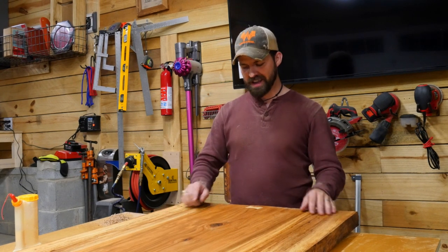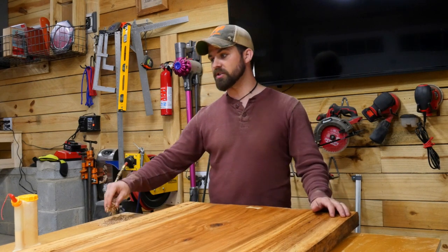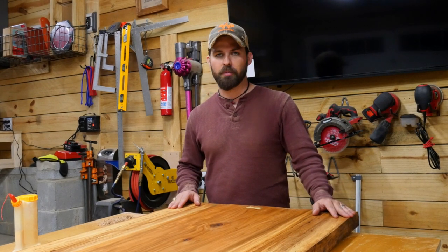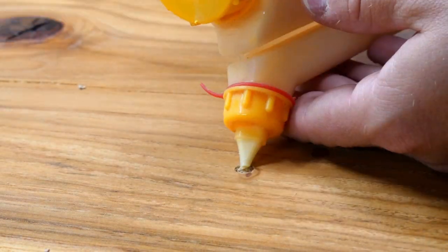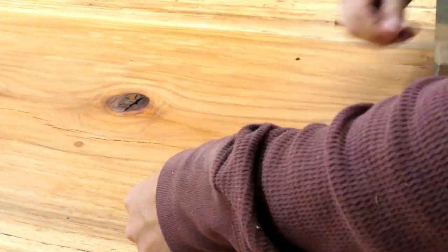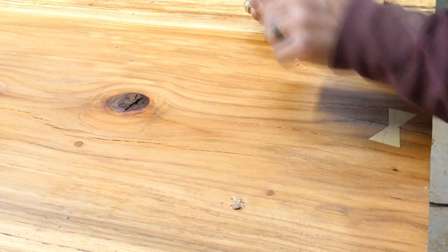I got all the strut installed and this thing is very flat now. However, mistakes were made when setting the nutserts — I accidentally drilled two holes all the way through the slab. So now I'm going to take some sawdust, since I have a bunch of shavings from routing those grooves, pack these holes full of pecan sawdust, and re-finish the whole thing with Rubio Monocoat, hoping these holes blend in with the rest of the pecan and aren't too noticeable. The process was simply layering sawdust and wood glue and packing it as tight as I could, then pressing in a quarter-inch dowel rod until it was bulging out of the top. When I go to re-sand everything, I'll sand these flush with the slab, and since these wood chips are the exact same cut of wood I'm filling, hopefully when re-finished they'll hardly be noticeable at all.